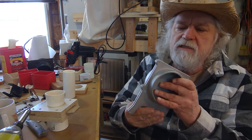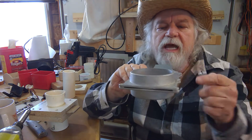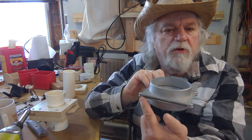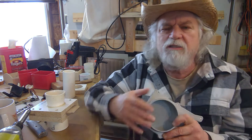I've seen some gates where they solve the problem by just leaving it open on the end, so when you open the gate, air can suck in there, and when you close it, all the sawdust is pushed out so it never builds up. But you do have a vacuum leak. On 4-inch type dust collectors, that little bit isn't quite as critical — but still, why have any loss if you don't have to?